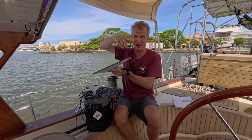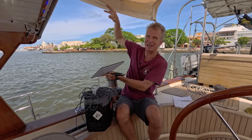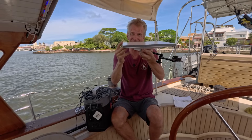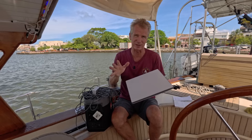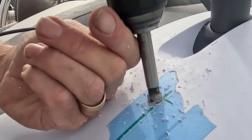When we're swinging around at anchor, north is one way and I quite often have it on one side of the boat sitting at a slight angle. It might be the bimini with its solar panel blocking it slightly. When the boat swings right around and the dish is pointing the wrong way it loses connection, so I need to wait and see once I've got it mounted in clear sky completely flat whether it'll stay connected all the time. On the old Starlink, I drilled it to disable the motors to keep it flat - you don't need to do that anymore because the app lets you set it to flat.